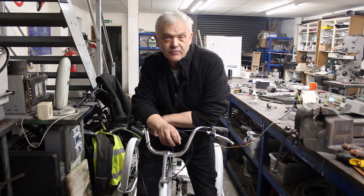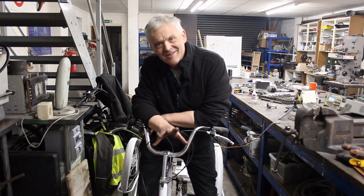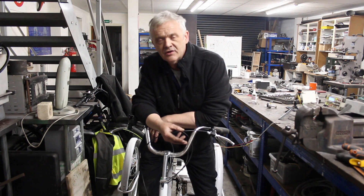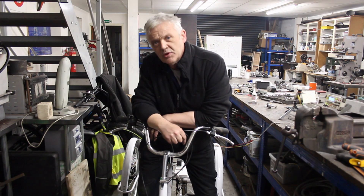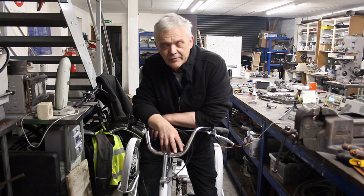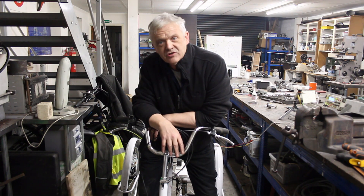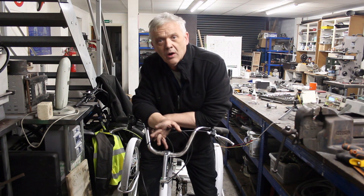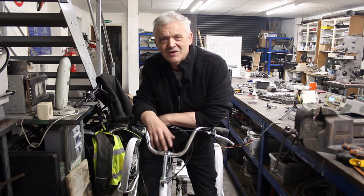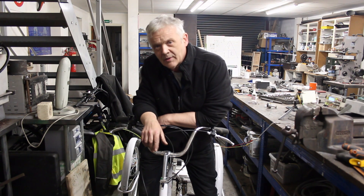The power out has a little to do with the machinery — the machinery helps you capture and translate it into electrical energy — but really the power out is the power in your legs. Most people have about 120 to 140 watts in them; athletes have about 160 to 200 watts. So you can expect around 120 watts or so from this setup. That's why a hand crank generator maxes out around 40 to 60 watts — that's what you've got in your arms.